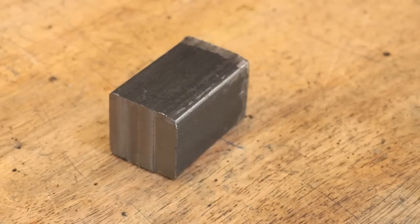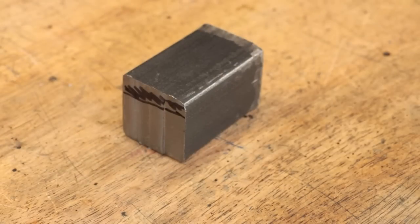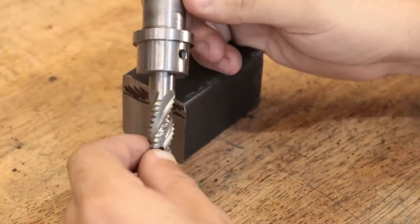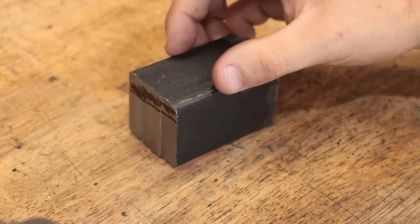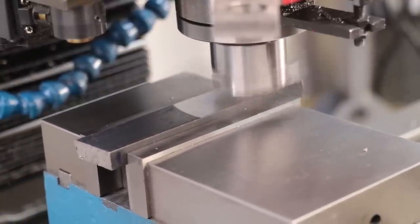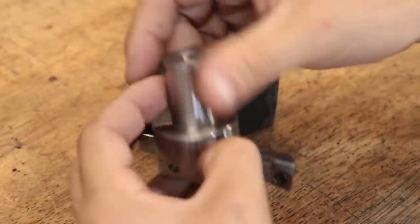Let's take this piece of steel and say I need to take 10mm off the top. There are several ways of approaching it — you could chop most of it off with a bandsaw or something similar. You could come in with an end mill; not the fastest method and I'd probably flood it to stop the cutter burning up, but it works and I've done it that way a lot. There'd just be a fair amount to clean up afterwards. You could also fly cut it, but fly cutters really only work best as a finishing tool — that single cutting edge really limits how fast and how deep you can push it. And that's where a face mill will come in.